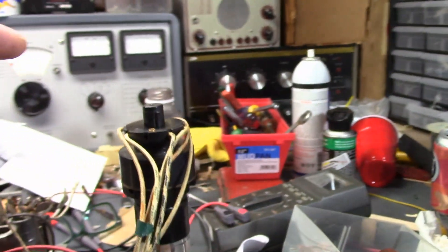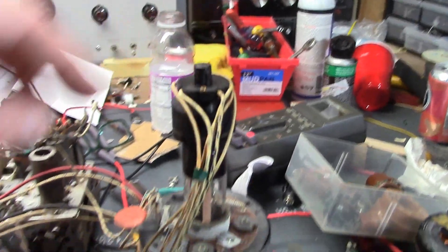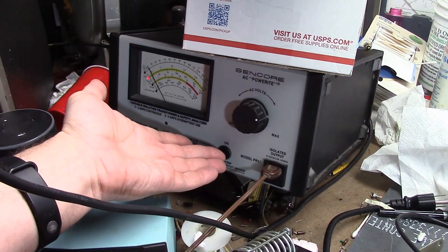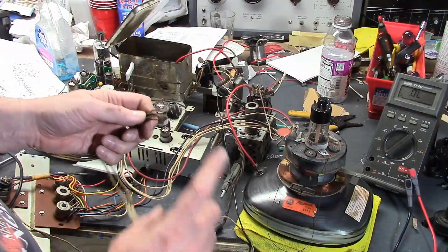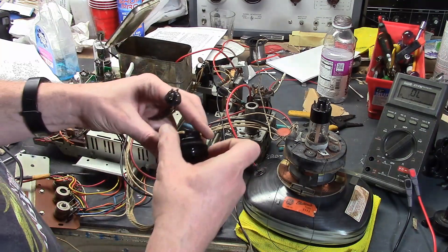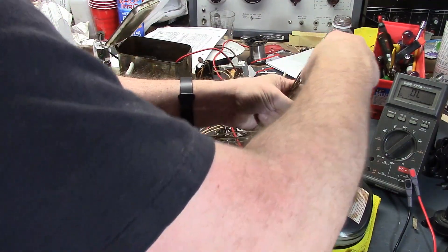Alright, here is an adapter I rigged up — octal to this adapter, to the button base type connector into the chassis. Yes, we do have continuity, we are drawing current, dial lamp is lit up. The CRT filament is lit up; I'm sure everything else is lighting up. We are on our way. I'm pretty sure I had switched G1 and G2, so I traced out the wiring, verified it with a continuity checker on my multimeter, and I think I have it right. I identified the two pins, heated it up, pulled the wires out, flipped them, put them back down the sleeves and heated it up.